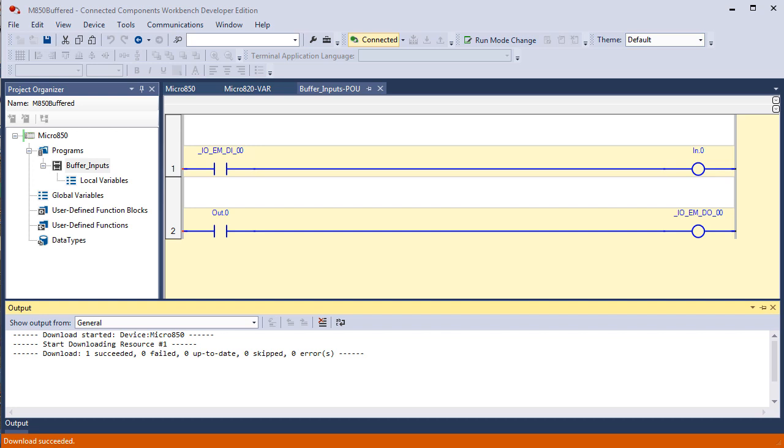That includes the I/O interfaces, the programs that you write, anything that comes externally through the communication ports from HMIs and other devices, variable frequency drives that you're controlling. Not only do you send signals to VFDs, you receive information back from VFDs that you can use in your logic to better control the VFD. Same thing with motion control. We have this chunk of memory, and in front of you, you have 4 unique memory locations.